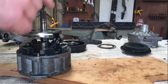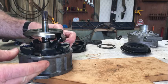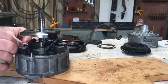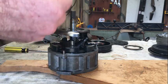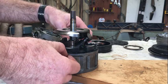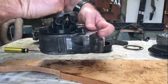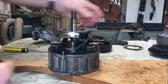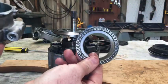Once you have all the pistons in, gently rotate each of them so they're all nicely aligned so the gasket can fit over the top. Now put the gasket in — there's a dowel on each side, so you can just look and work out which way it needs to go. There are two bumps on the gasket — they go on the other side to where the high pressure outlet area is. Once it's sitting on the dowels, get the top piece. There's the thrust bearing which is going to go there.